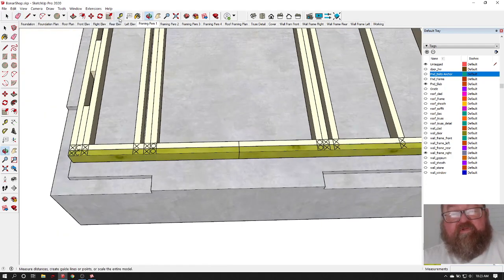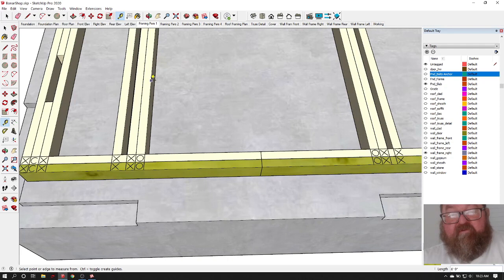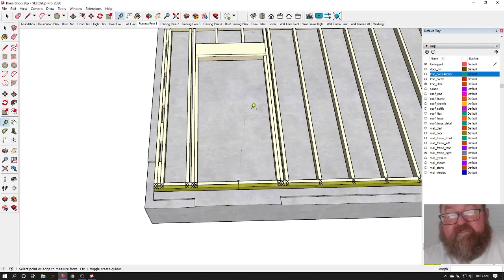Then you take the rough opening, which in this case is 38.5, because we're using a Therma-Tru door, which requires another 1/2 inch. Typically doors, exterior doors, or even interior doors, you have to allow 2 inches: the size of the door plus 2 inches. So if it's 36 inches, you would normally allow a 38-inch rough opening and 2.5 inches on the height. So this is 82.5. It's 6 foot 9. We'll have to fix that. Oh, look, I'm measuring from, okay, yeah, 6 foot 10.5. I was measuring the jack.